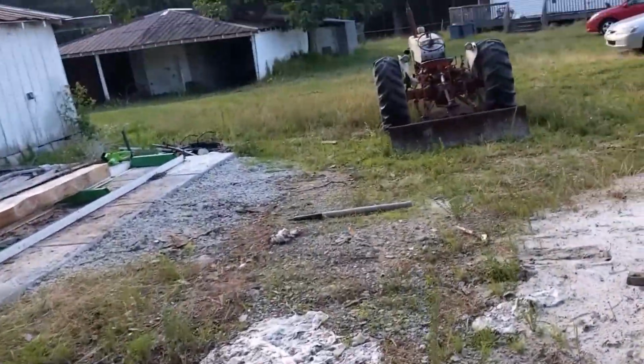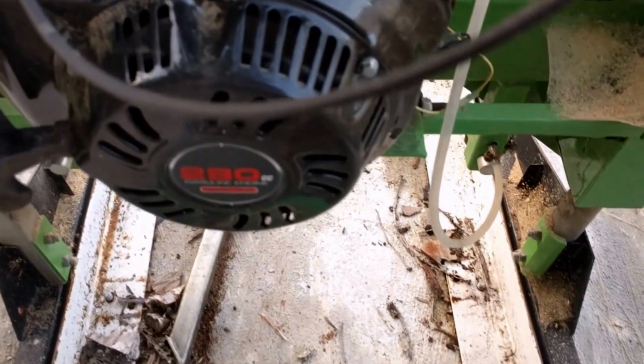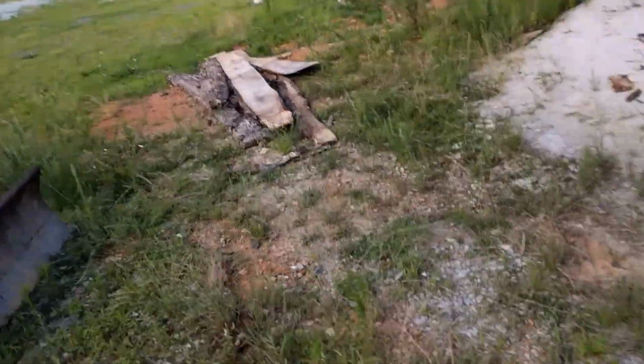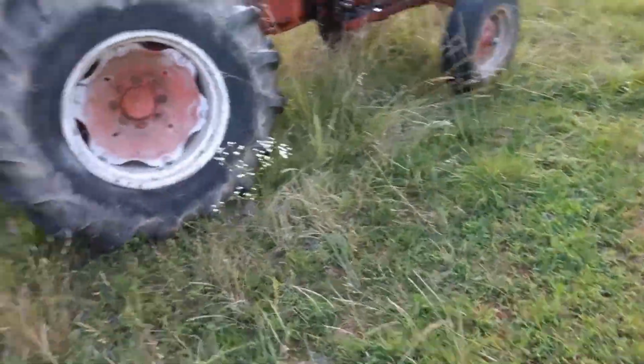The process works pretty well, and I've built several buildings and such out of wood that I cut down on the property. I have a lot of old outbuildings here from about 1948, so I used the wood from the property to maintain those. I have basically just been air kilning, which takes a few months. But I find that you can also build green as long as you structure everything appropriately for shrinking.